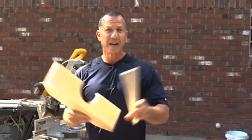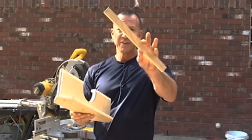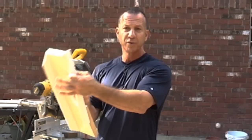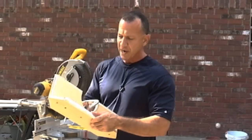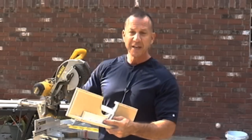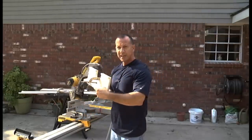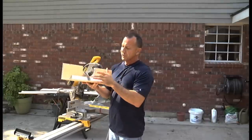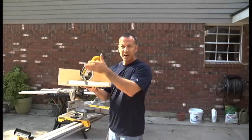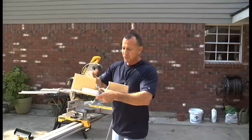Here you go — this is the entire system right here. My one piece is made from three boards, and then I had this ripped off as the one-inch strip. I use this when I'm cutting smaller crown, and you'll see what I mean in a few minutes. The reason the lip goes toward the wide side is because it's specifically made for my largest crown. For the smaller crowns, I'll use this piece where I can slide it up and down, clamp it, and keep the crown in position.